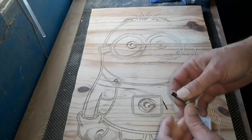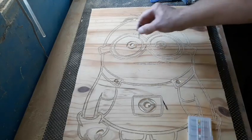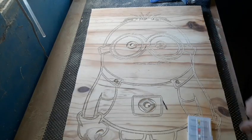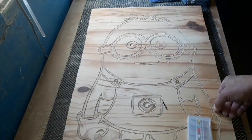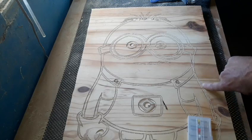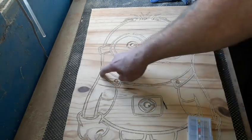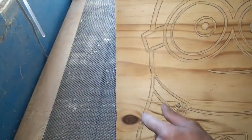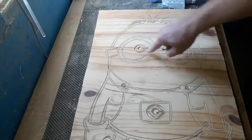So we'll set it to that depth and there are plenty more projects out of that pack. Slotting this one into the silver end adapter — the darker end goes into your router bit — and we'll set it to that depth and start clearing out all these sections. I did get a little bit carried away on this one. I had every intention of leaving the outer line around the outer area so I'd have something to follow with my scroll saw, and then route out the section afterwards. But I got a bit carried away and CNC'd right over that line. It's nothing major — just makes it a little more difficult when we come to use the scroll saw because we haven't got a pencil line to follow. We'll get around it. Okay, let's set this in our little router and start removing the inner bits.